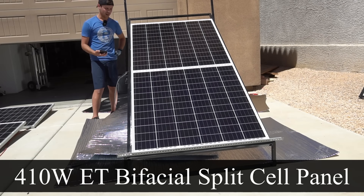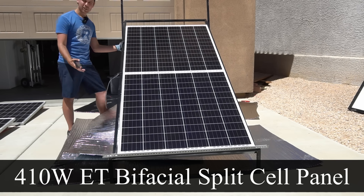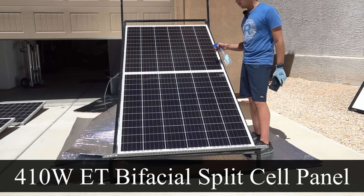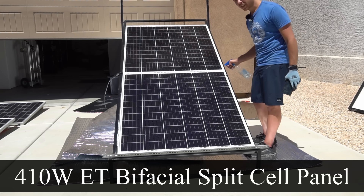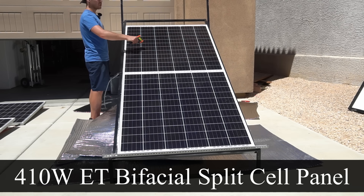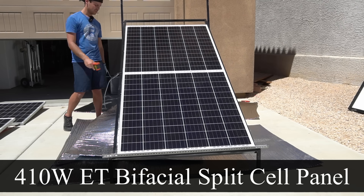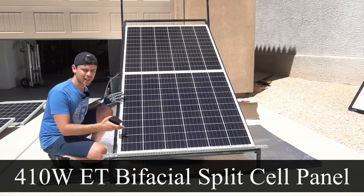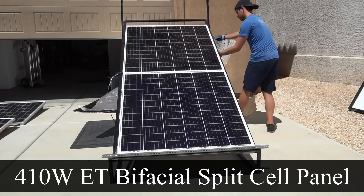I was expecting much higher output. Reading studies on these panels, they need to be at a colder working temperature to really benefit from feeding photons into both the back and front. Let's spray it down with water. These bifacial panels seem ideal for cold climates or far from the equator, but out here in the desert, once the cells hit a certain temperature the output decreases significantly. After spraying, we hit 401 watts — but the cells are at 142°F, which is pretty much the maximum on data sheets for desert environments. With reflectors removed we're pulling 393 watts — only about 10 watts from the reflectors.